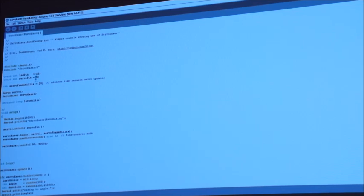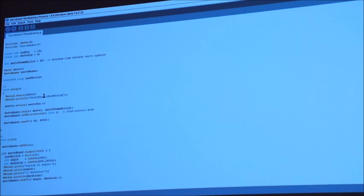It's got some bits of clever code that you can play around with. And what servo easing does is, you can see the command just there. What it's actually doing is it's moving to the 90-degree position, but it's going to take 5 seconds to do that. So the 2 numbers are, where's it going and how long do you want it to take to get there?